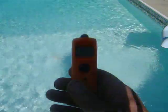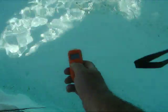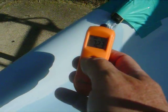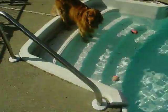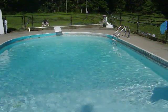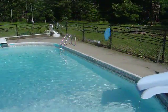I've got an infrared thermometer here. I'm going to touch it to the pool water — it says 72.3 degrees. Now if I touch it to the water coming out of the solar heater, it's up to 78.3. So it's 78.3 going into the pool and 72 coming out. This morning when I started, the water was 68 degrees and now at about four o'clock in the afternoon it's up to almost 73 degrees, with the solar heater output at 78 degrees. Around noon it was coming out at about 80 degrees.